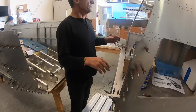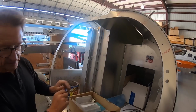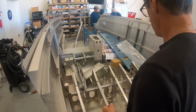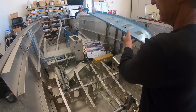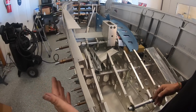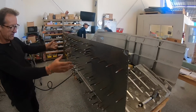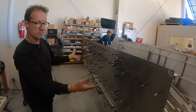Right. And then we'll do, of course, our other side skin will be on too. We'll do a little cleanup. Then the next stage is going to be the final check on the center fuselage, which has been Clecoed together. We'll do the inspection of all the controls, and we'll do the final riveting of these skins on. The reason we leave this like this is, one, it's been a pre-fit, and now it's ready to be riveted.